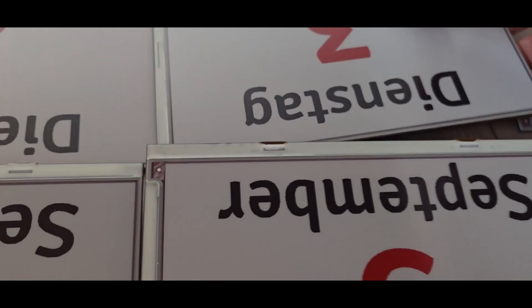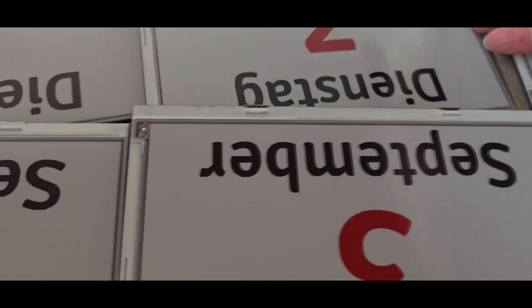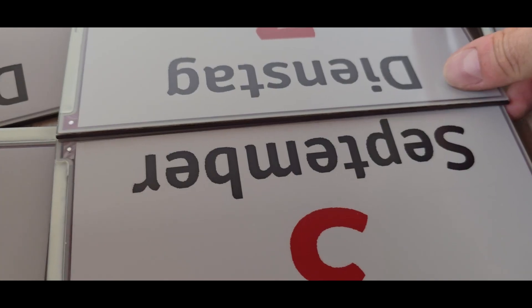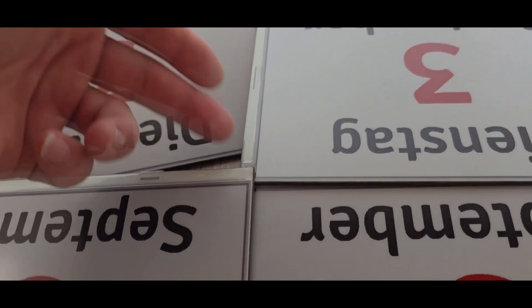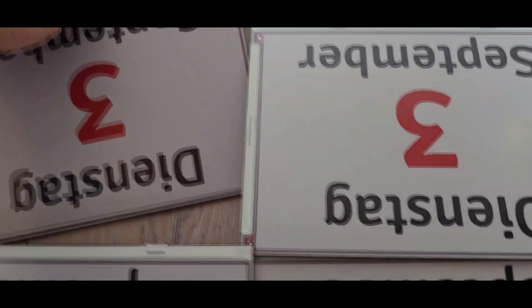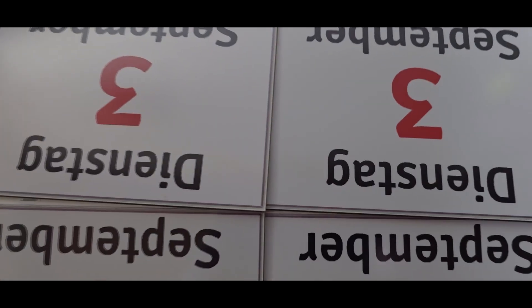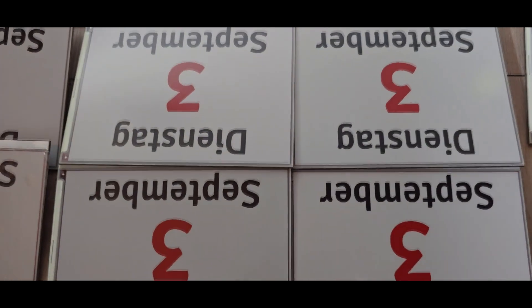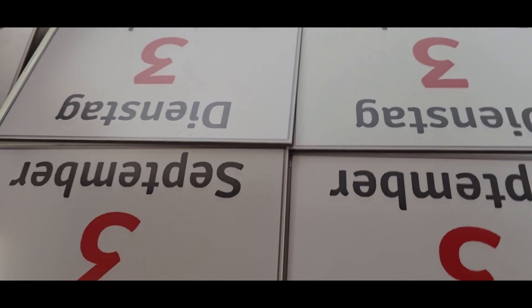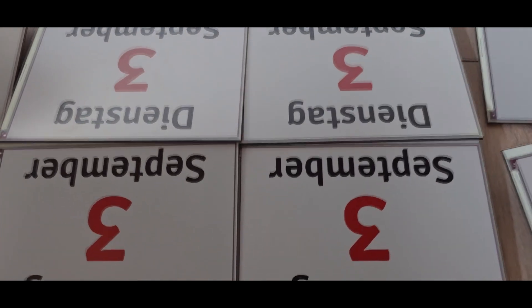The plan is to overlap the displays so the border where the controller ICs are gets hidden behind the next one. At the same time I also want to overlap to the left, and at some point it gets tricky because you end up with four displays stacked on top of each other. If the holders are designed correctly, we'd have maybe just three to four millimeters of overlap — a visible line — which is the best result so far. On the other ePaper walls it was really like a bezel of maybe one centimeter between each display, so this will look way better and more complete.